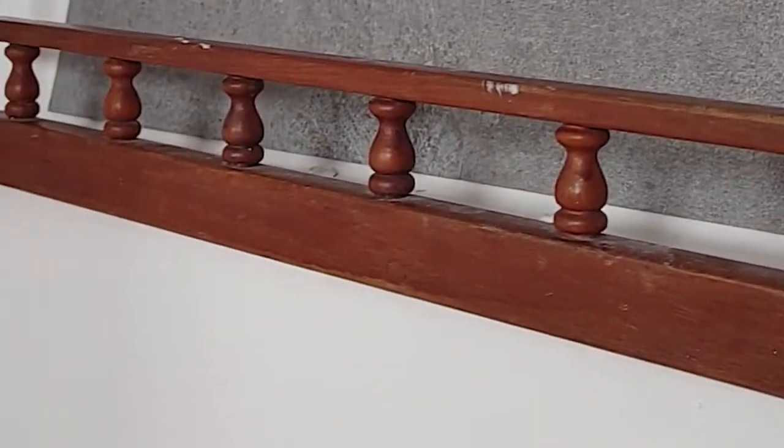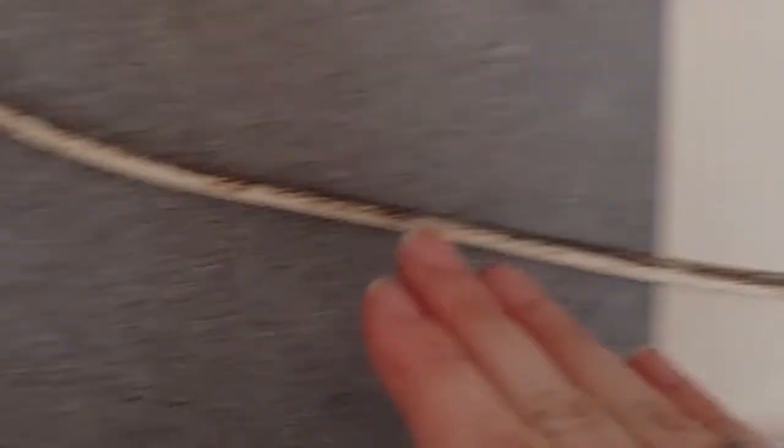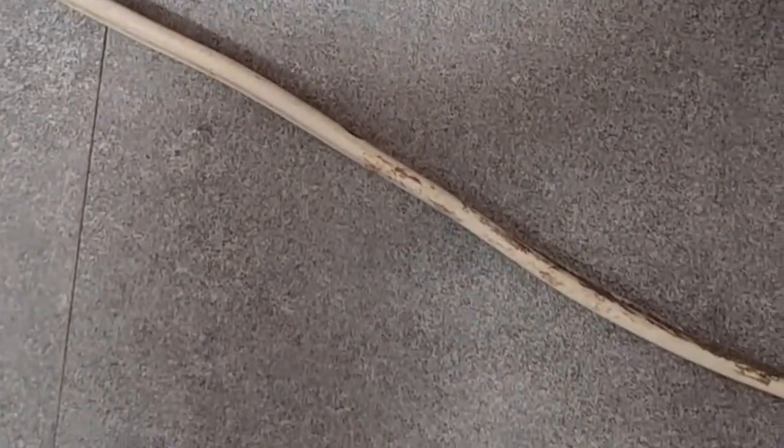And this is what it looks like so far. So I basically use this as my starting point, the very bottom here, so that it goes in a straight line all the way down the boat, and I'm cutting each piece of tile to go up to the very top, which is about 3 inches above where the visible line is, just to ensure that we have good coverage. And if you can see, there's a small little crease in there, and doing it this way ensures that we have a uniform crease all the way down. So every 12 inches there's going to be a vertical crease, and that's it. And that is what we're doing, and I'll show you guys the finished product.